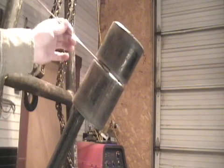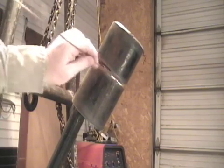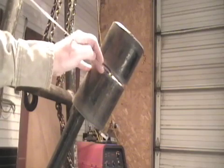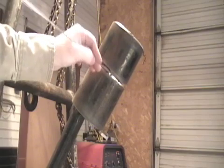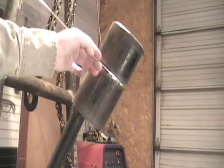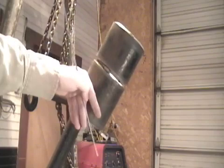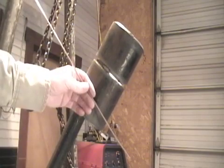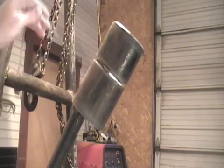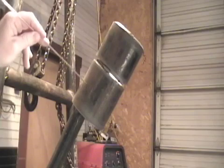Because I can't get my rod to the weld surface area without pushing it in from the bottom, and I don't like doing that, I'm going to use my grinder and thin that out — that's how I'm going to overcome this. I'm not going to worry about the open side; all I want to do is get my rod to the weld surface and begin the welding process. I'm going to go ahead and start filming without a lot of talking from start to finish.